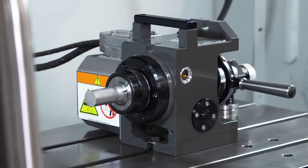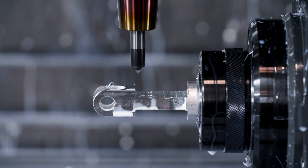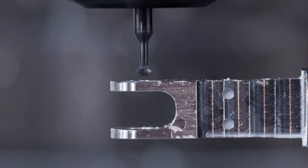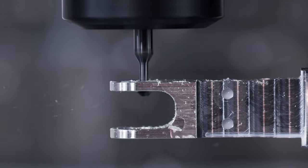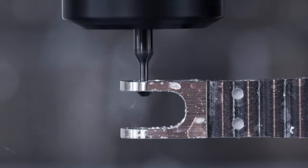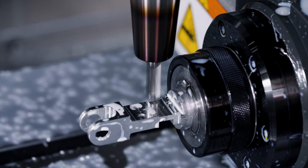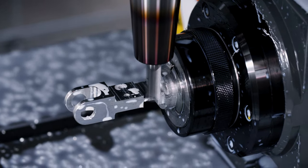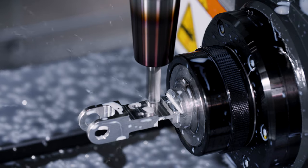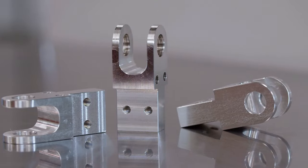This is today's version of the 5C indexer, where it all began, though this latest unit has evolved quite a bit over the past four decades. With the use of a 5C collet — one of the most common collets found in machine shops today — the 5C indexer is compact, lightweight, easily portable, and extremely capable. For parts one inch in diameter and under, the HA-5C is the standard within the industry and pretty hard to beat.